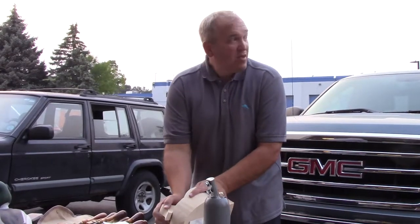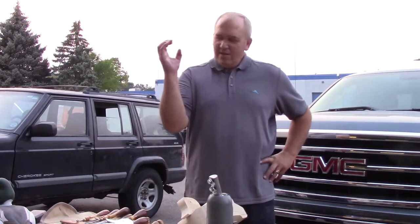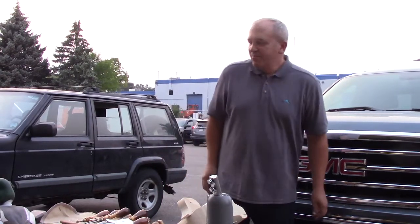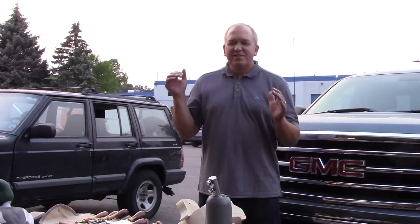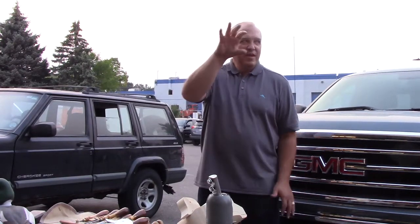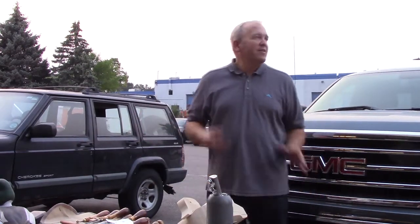Why would you hollow the head out? Well, weight, you want the mass at the bottom. So if you have too much weight at the top, this goldeneye I didn't hollow out the head on that one, but if it's a leaning decoy where you got the head out there, that's a lot of mass and weight up top. The more weight you have up top, it's gonna wobble on you, one way or the other. So if you get it lighter and you have more weight at the bottom, it's gonna be more stable. But if it's a low head decoy, you shouldn't have to worry about it. So it's very rare I hollow out the head.